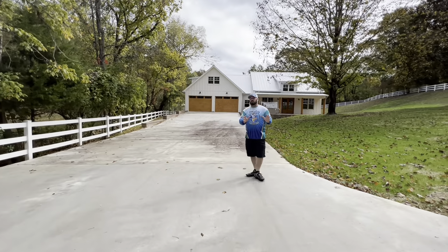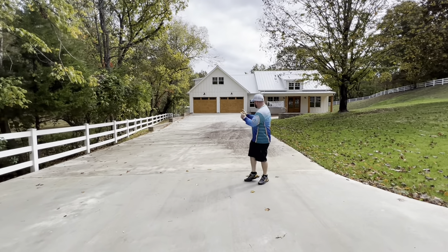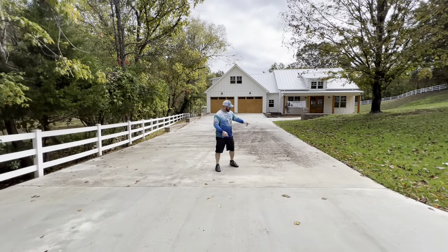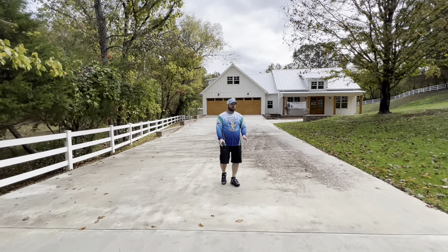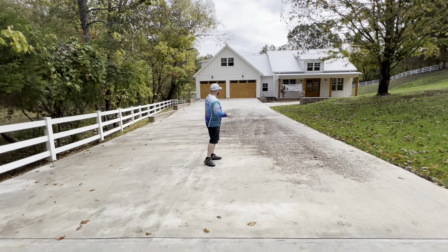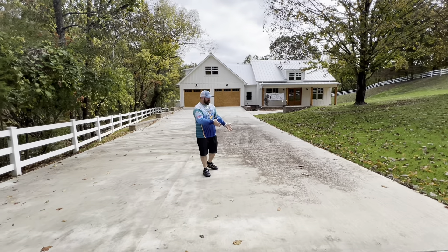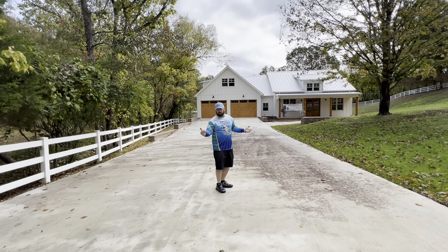We're here on the scene of a brand new house, just got built. All this is new concrete. What we're going to do is remove walnut and organics from the leaves. You don't want to pressure wash new concrete because you will tear it up — you'll etch it. So we're going to soft wash it. We're going to hit it with probably a 3 to 4 percent mix; if not, we'll turn it up to 6 percent. We're going to start off at 3 percent.